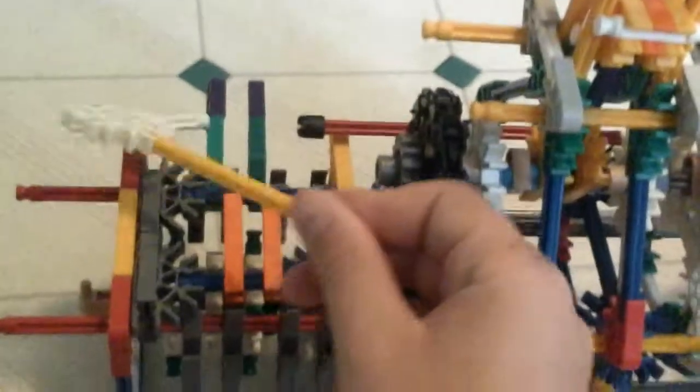It doesn't really work, but if there were power lines, it would hook up to these two things here. This up here acts as both a glow plug and a governor. As you saw in the demonstration, when it would come up, it would then go back down and fire. But when it was slower, it fired all the time because it needed that.